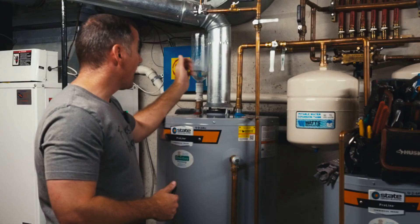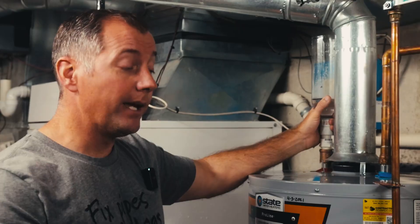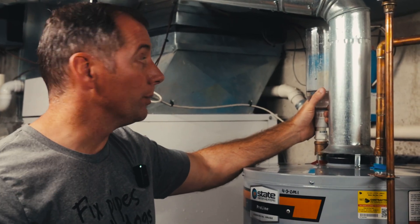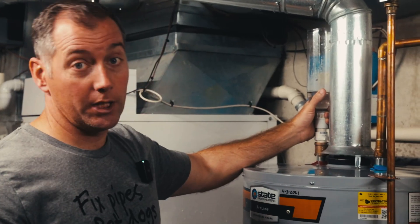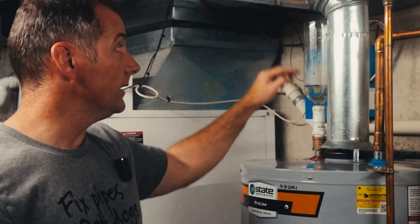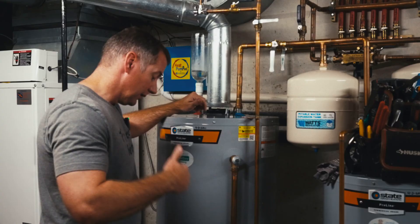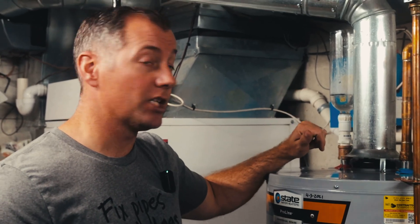This just happens to be a one-quart bottle that we cut the bottom off of and put on upside down. Right now our water temperature is a little over 50 degrees, mainly because it was coming out of my desuperheater tank, but we're going to get roughly the same idea as we turn this water heater on and let it heat. The tank is full all the way up to here — we have an open-top bottle. Let's turn the water heater on and actually see thermal expansion happen right in front of our eyes.